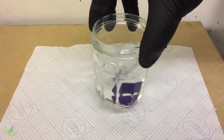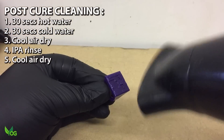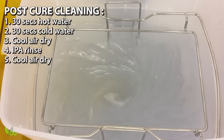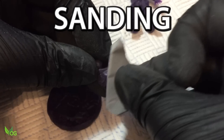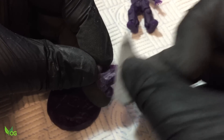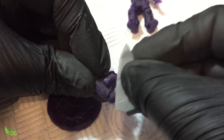Once fully cooked, the print is again rinsed in hot water for 30 seconds, then cold water for 30 seconds. I blasted with cool air to dry and finally rinsed for 30 seconds more in clean IPA, before a final blast of cool air to dry. The cured print tidies up nicely and responds very well to sandpaper. I found fine grey paper easily removed any leftover support nubs and also cleaned up any printer lines that I could see.